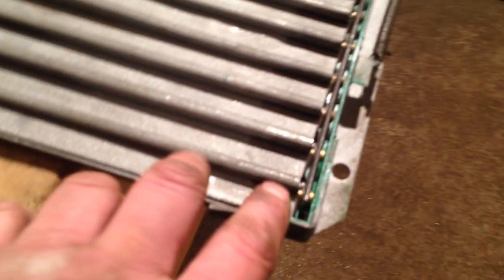As you can see, these rivets here - I was just going to use pop rivets, no one will ever see them. But when you pop rivet it together - or snap rivets as you might know them - it just nips everything up. So I had to make those rivets all individually on the lathe. They're like a shouldered rivet, and they had to be just right. Oh man, what a job it was just getting them right.